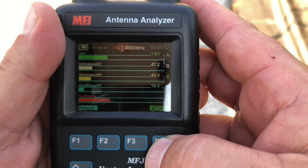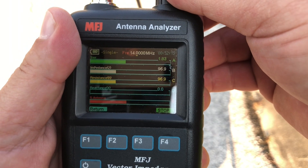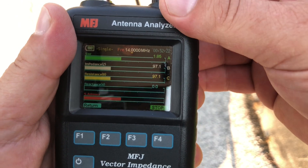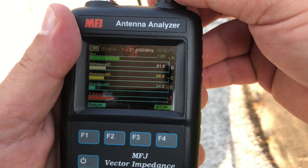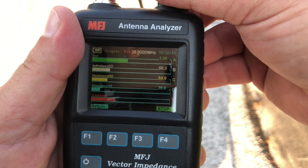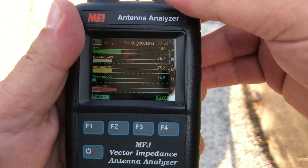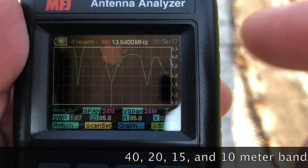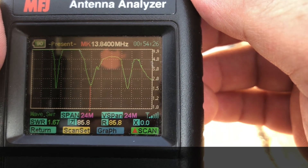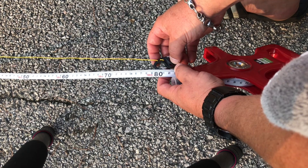Looking at it now — it seems to be better; it's not going as high an SWR. I think we're getting pretty close to the sweet spot. 15 meters is looking really good now, and 10 is looking really good too. That's pretty wide — under 2 to 1 for the sideband portion of 10 meters. Here's the whole scan of the band and you can see it's below 2 to 1 on all the frequencies. I think I'm going to stop where I'm at — I don't know if I'll really get any more by cutting this. Our total length ended up being pretty much exactly 65 feet, or for those of you across the pond, 19 meters 80 centimeters.